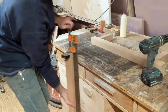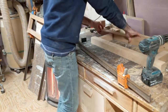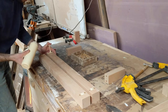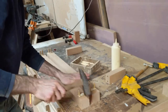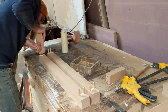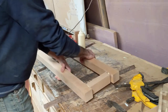With all the holes drilled, I can start putting it together. I made sure to add plenty of glue in the dowel holes as well as the pieces themselves. Once the glue is added, the wood absorbs some of it and swells up a bit — that means the holes get tighter and the dowels get larger. In this case the dowels already had a pretty snug fit, so for the rest of the joinery I made sure to sand them down to prevent possible mistakes.